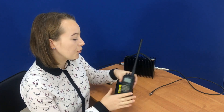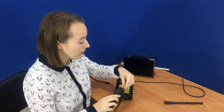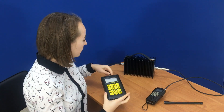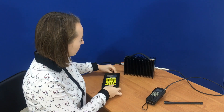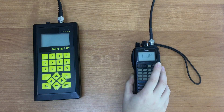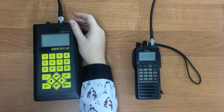Conductive test through a suitable attenuator is required to check the portable transceiver. We connect the transceiver ICOM to the GT1 tester via cables and through an attenuator. Turn on the station by pressing and holding the power button, and adjust the frequency to 122.2 MHz.